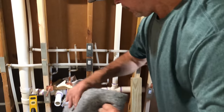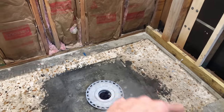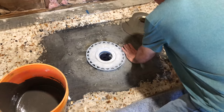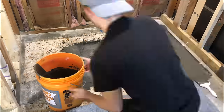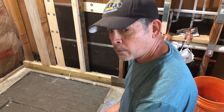You got it all vacuumed? Yep. I'm going to go get our screed boards ready. Just pour some of that thinset in there, use a brush and dab and coat all that. You want to coat all the gray or the rocks? Yeah, the whole thing — make sure you get it in all the little nooks and crannies. We're ready for our dry pack. It's in the wheelbarrow here behind Jordan. We already put thinset down right here.